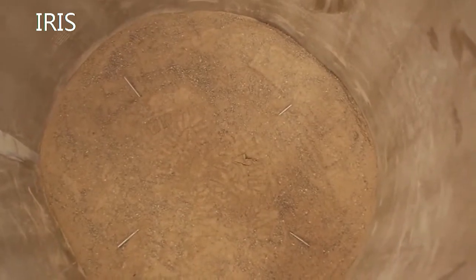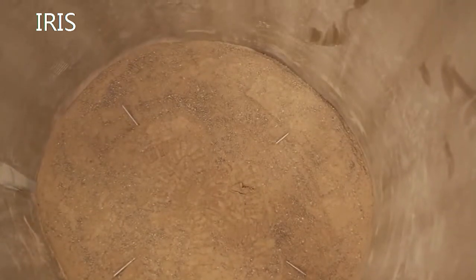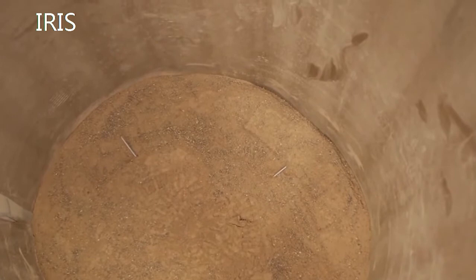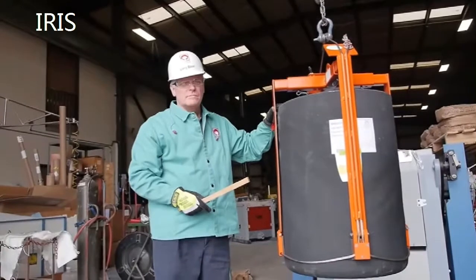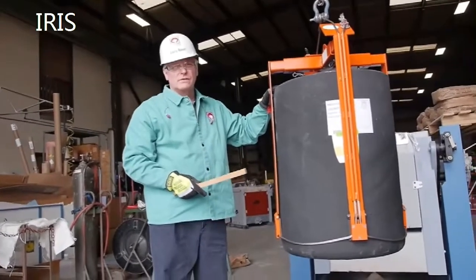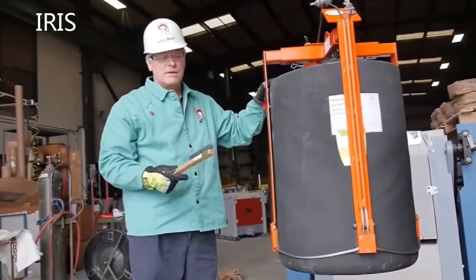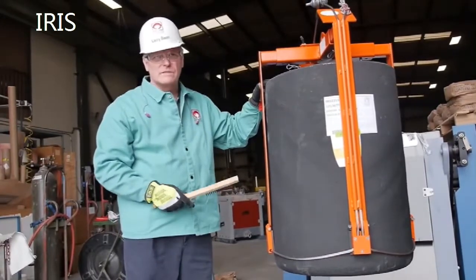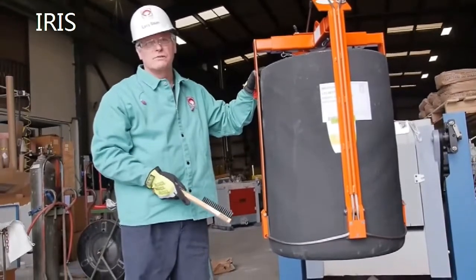You'll note that the bottom of the furnace has been rammed and that the leak detectors are in place. The leak detector wires need to be in intimate contact with the bottom of the crucible, but not penetrating the bottom surface. It's important to remove the bottom glaze of the crucible to ensure intimate contact with the ground fault wires. This can be accomplished using a wire brush or a hand stone. Do not, under any circumstances, use a power grinder, as this will remove part of the crucible structure itself.